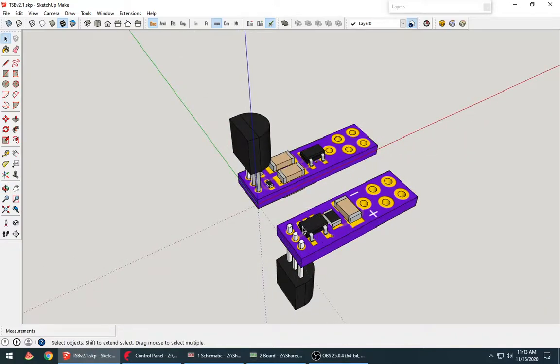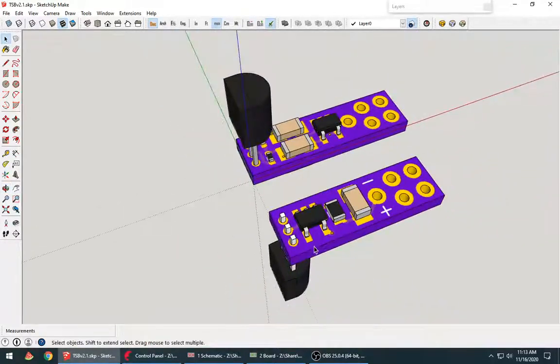So this op amp, an ideal one, would not need any, infinite input impedance. So it would not draw anything from here while sensing the voltage coming out of this. In reality, there is a current going into the op amp, but it's negligible. It's very small. So instead of directly filtering and sending, which would be the same thing that I did originally, just putting a buffer in here.